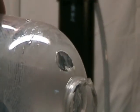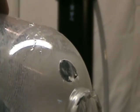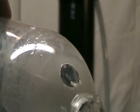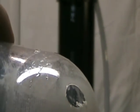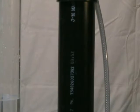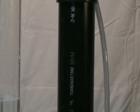The holes allow the water bottle to be submerged in the water. We use an empty water bottle displaced by HHO to measure how many liters per minute our cell produces. It's a very accurate test. Flow meters give an inaccurate reading because we don't have the PSI to get a good reading on them.